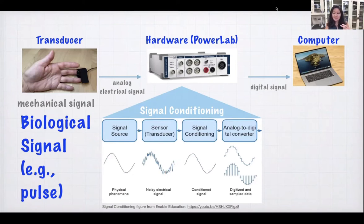Two important things that this instrument does: it does signal conditioning, which includes amplification. It has a built-in amplifier right here, which basically increases the size of the signal and increases the gain. A lot of the times the signals are very small, so it makes them bigger so they're much easier to work with. It also has the ability to filter the data to remove the noise and increase our ability to see the signal while minimizing the noise. And finally, the analog to digital conversion happens, where you chop up this continuous voltage signal into a whole lot of discrete measurements that the computer can then handle.